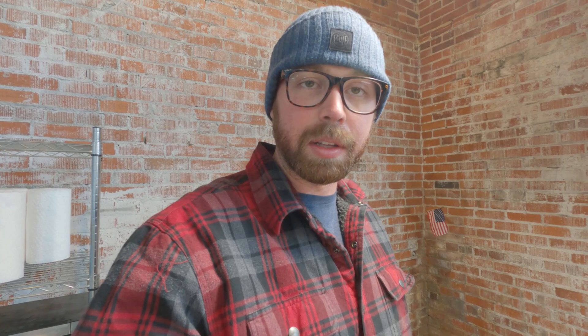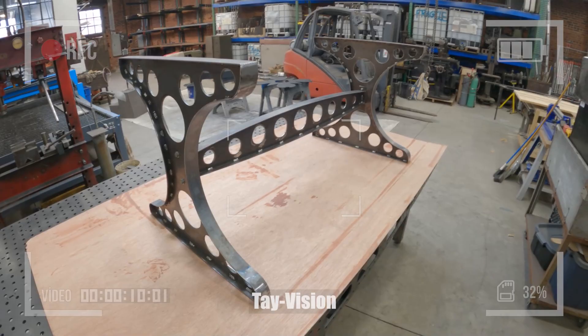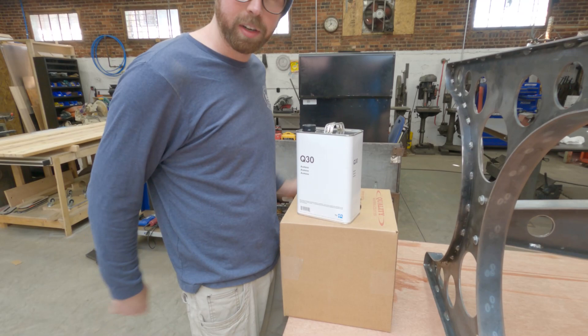I have Stella without May today — can't tell if she misses her sister or she's just tired. You're okay. Anywho, let's finish this table. We'll fill the cracks with resin. Once it dries we'll sand it and then put on a natural beeswax oil finish — food safe finish, really easy to apply, much easier than a clear coat or a stain. It'll darken the wood quite a bit so it'll look good. The one thing I have to do for sure is drill holes in the top flange so that I can mount the top. So we'll do that and then we'll clean it up. Box of rags, acetone — let's clean this bad boy.